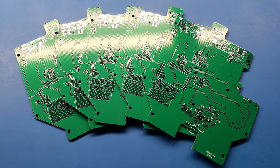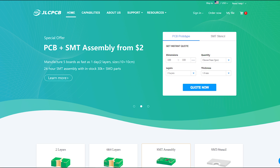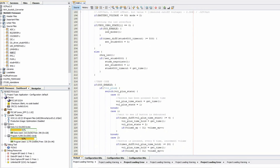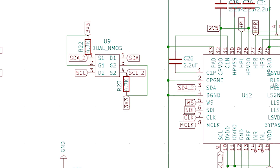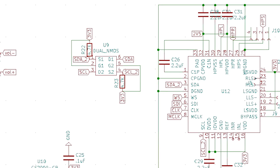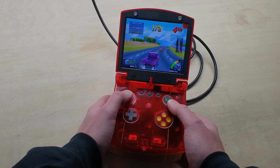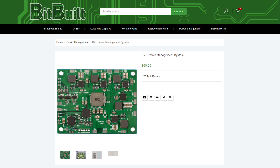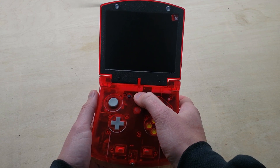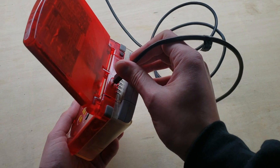The PCB looks great and their customer service always impresses me. Their turnaround time is super quick, which helped me make progress on this project quicker. There's a link in the description where you can check out JLCPCB. The code for the audio amplifier was absorbed into the power management microcontroller, as it seemed overkill having three microcontrollers on one PCB. A logic level converter circuit was added because the power management and audio amplifier are on two different I2C bus voltage levels. The joystick converter MCU will remain alone to avoid any latency issues. The PCB also integrates the PMS interface, also available on the BitBuild store. The N64SP is turned on and off by holding the power button for one second. The LED warns you when the battery is low and indicates when it has begun and completed charging.